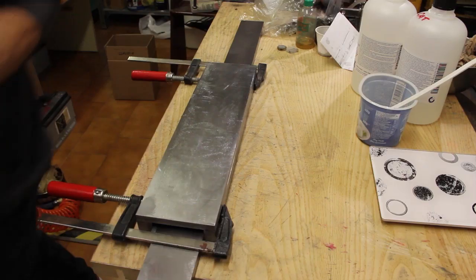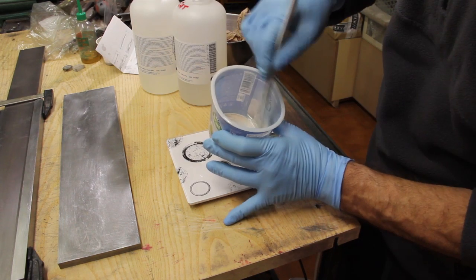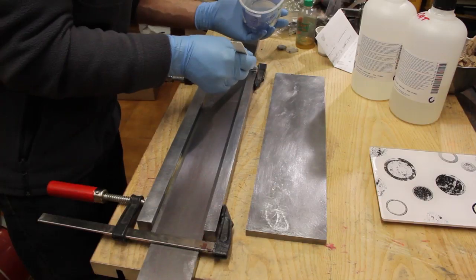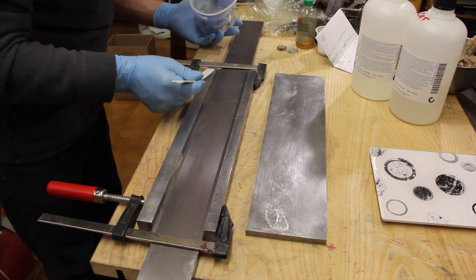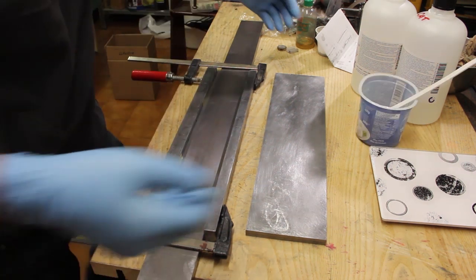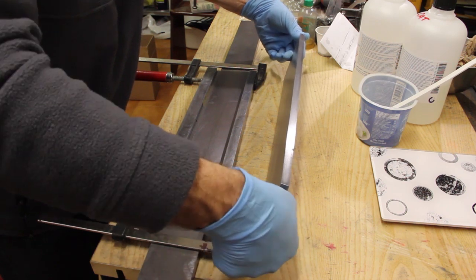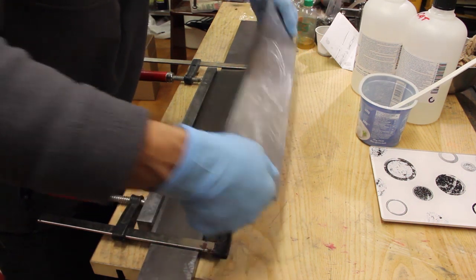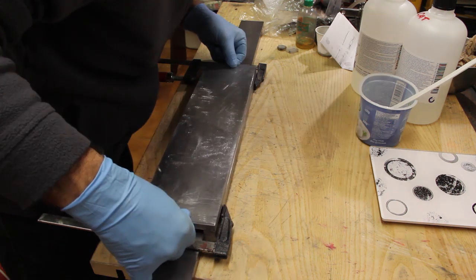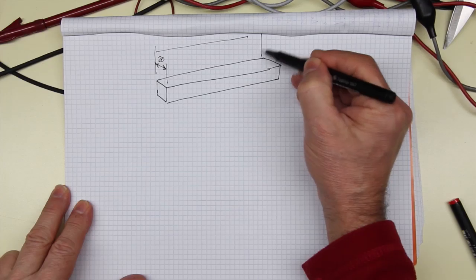I eventually join the parts together with epoxy resin. Is the bonding able to withstand the same force as welding? No experience here, but in theory it should. An alternative to welding would be brazing, but that would require an oven and it would be impractical because there are parts that need to be attached from different sides at the same time, and the whole ensemble is quite cumbersome.